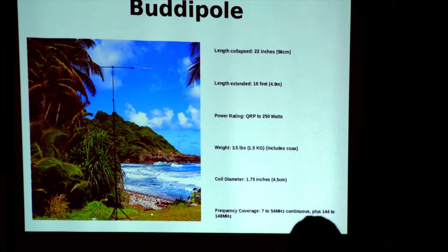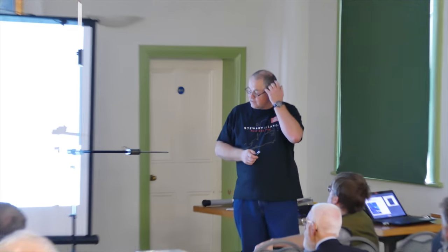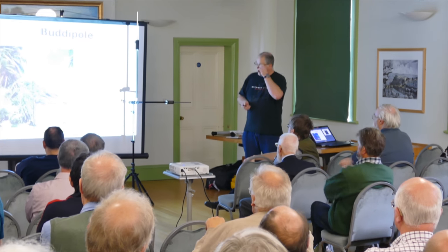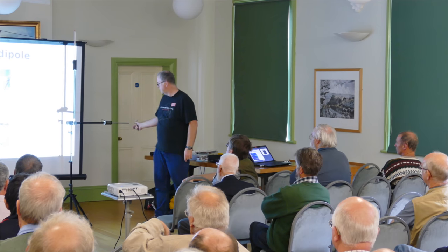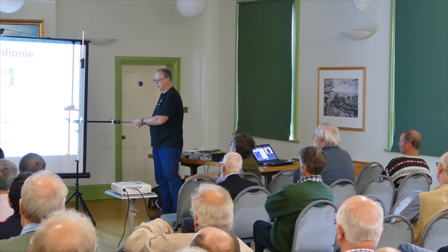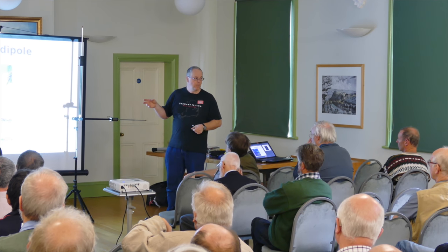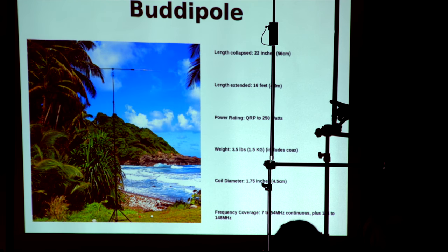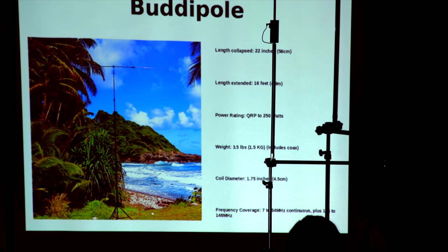The buddy pole — here's one I assembled earlier. It's a nice simple antenna with lots of different configurations. I prefer using it in an L shape with a tuning coil here and another one here with whips. Be careful, it's a bit unstable. You can make it into a resonant antenna at the frequencies you want — horizontal, vertical, L shape, V, upside down, there's a whole range of combinations. Put it into the EZNEC modelling program for your specific location and see what difference the configuration makes.